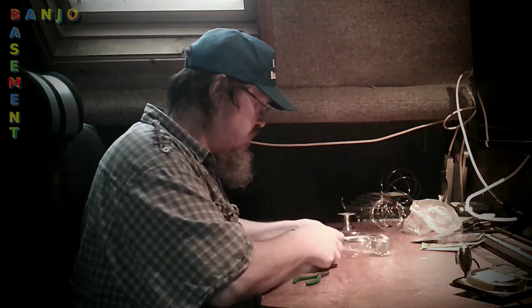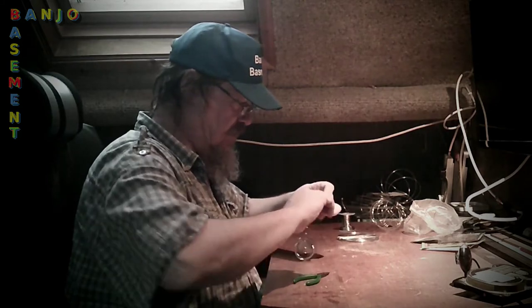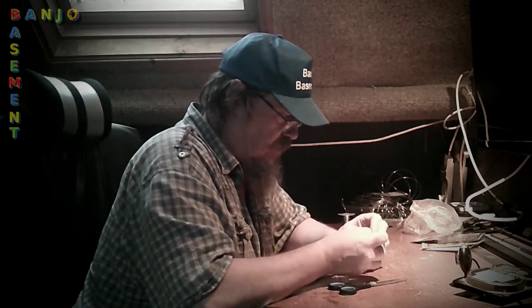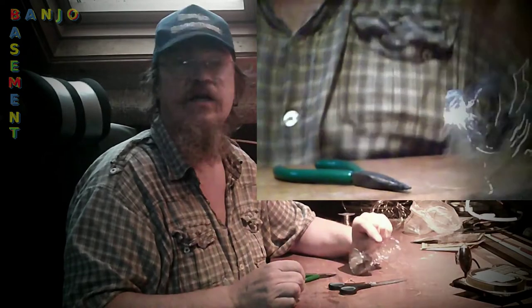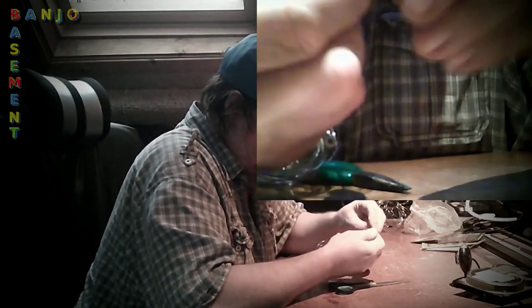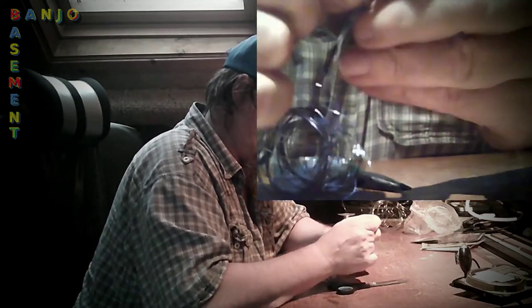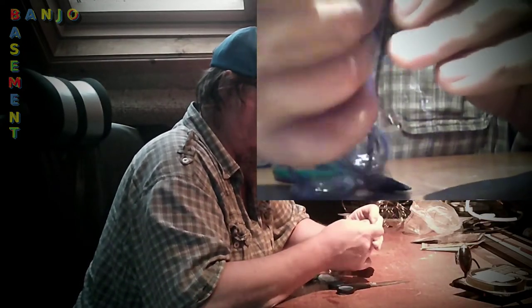Now I can introduce my new wire. Make sure that it's not kinked anywhere. I've got a reasonable end. I'm going to now form a little loop — something of that nature. And then I'm going to put my ball end in the loop, trying to get the wire in the groove, in the middle groove of the ball end. And then I'm going to pull that really quite tight.